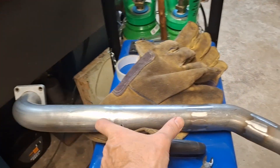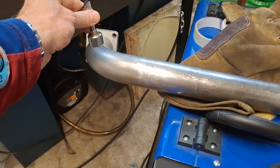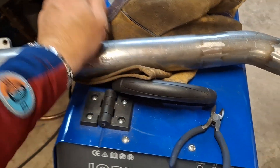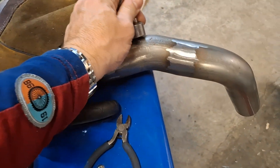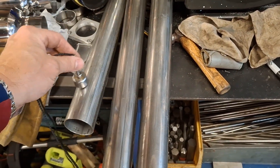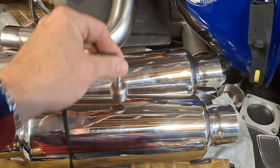Because then you'll have one section of pipe that goes rusty and the rest of it looking really sharp. This is the steel, and as you can see, steel is magnetic — that's a steel piece, no problem all the way along. And over here we've got the stainless, which isn't magnetic. That's how I'm going to test each piece before it gets welded in.